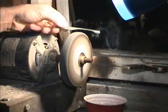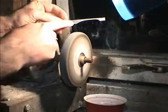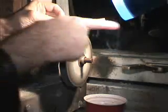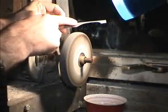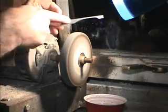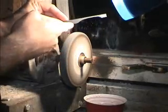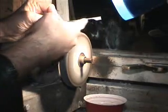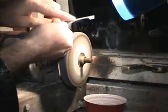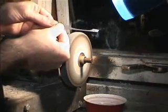A blank basically can be made into almost any pick, as I said before. If you would like to make a snake rake, I would recommend grinding from both sides and having your shaft come out of the middle of the metal rather than just one edge or the other. The benefit of grinding the blade part or the sawtooth part is that you have a nice flat back. That's a good standard to know what you're doing.